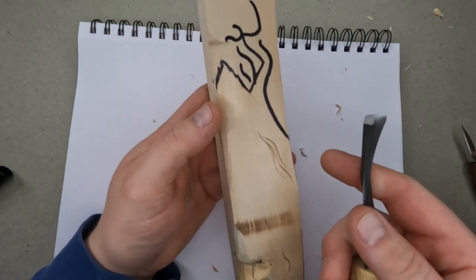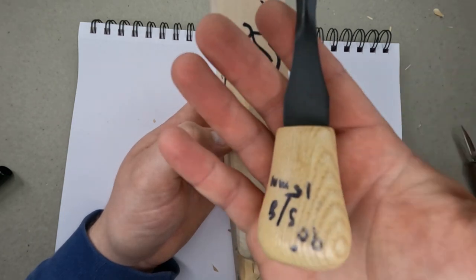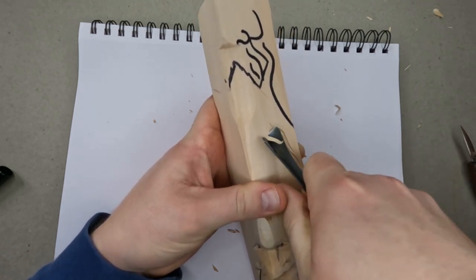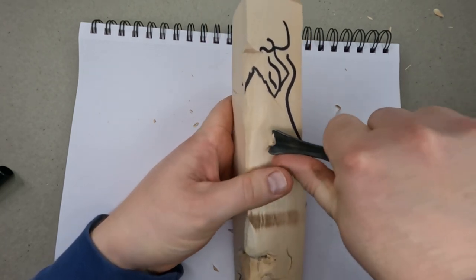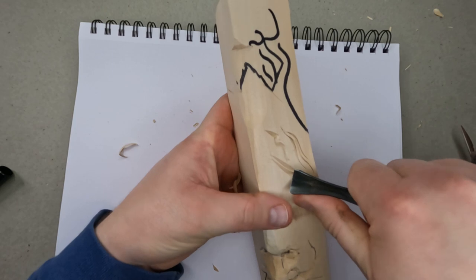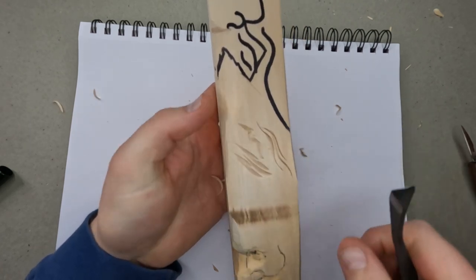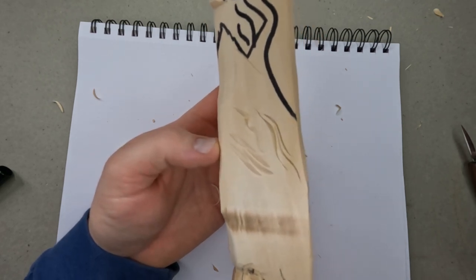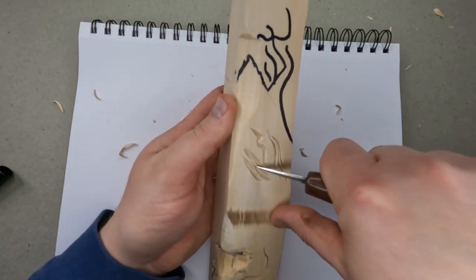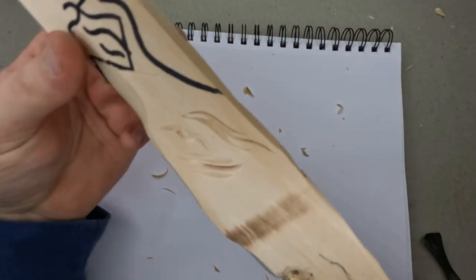I will show you that you can do this with a v-tool. This is a 90-degree, five-eighths, 15-millimeter v-tool — I said all that because I got it noted on the back so I don't forget. You can do the same thing with a v-tool. With different degree v-tools that are out there, which are numerous, you can get different results. Sometimes what I like to do to give it some shadows is do a v-tool cut, then find which line I want to go deeper and just trace that with my knife. Come back in and give it some shadow, like so.